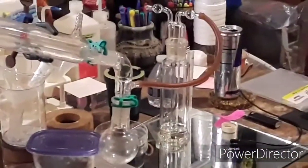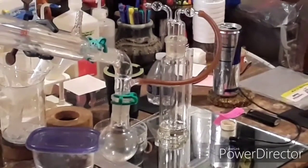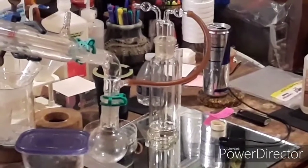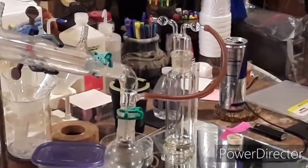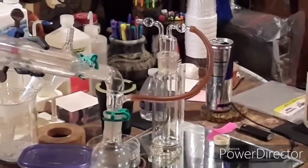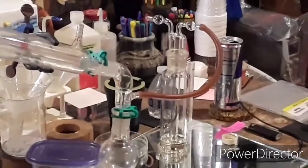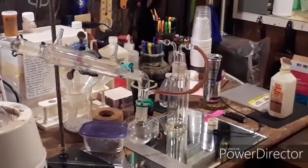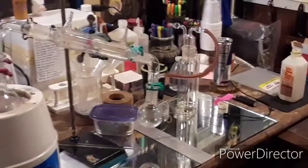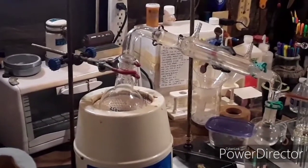Right down into our receiver, you can see I've got my washing bottle with 90% sulfuric acid in it. The reason I'm using sulfuric as a scrubber is that any sulfur trioxide that escapes will essentially turn it into an oleum. That's pretty much what I'm using the sulfur trioxide for anyway, so it'll just give us a more concentrated sulfuric acid. No unwanted reactions there at all. Let's go ahead and turn on the heat and stirring, and let it rip.